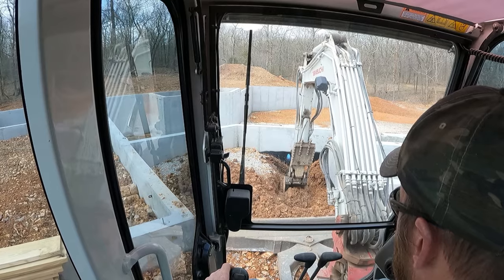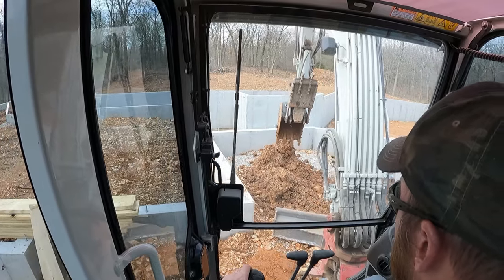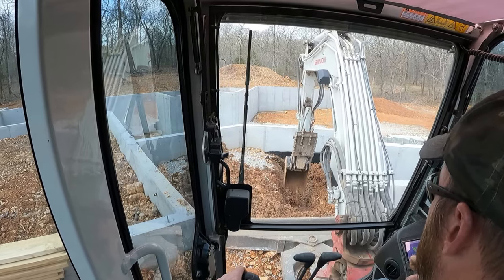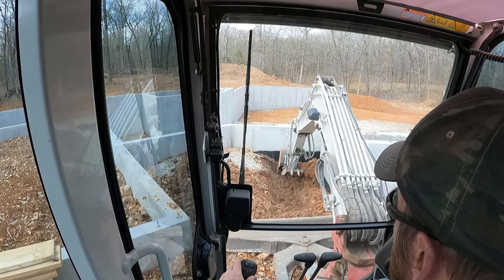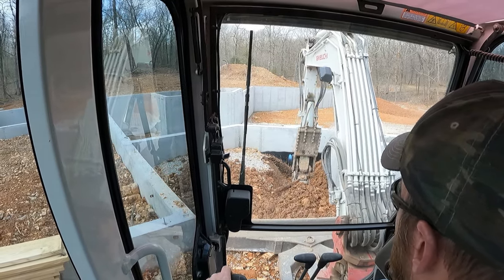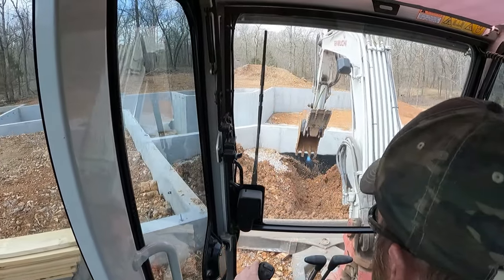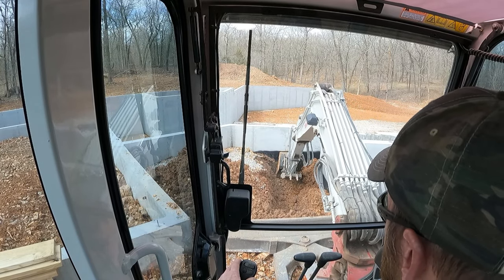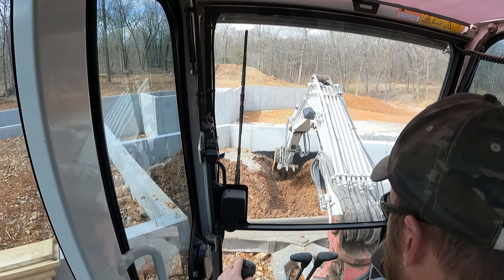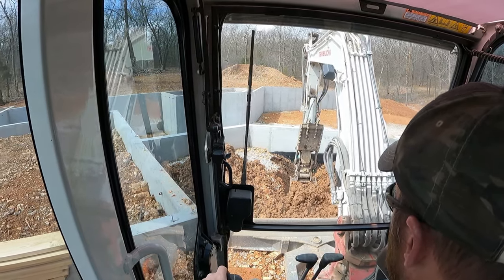And the reason that they do two lines here, the sewer bill is based off water usage per month. So let's take my house for example, I got a 12 zone sprinkler system in my half acre yard. In the summertime, I will go through 70 to 80,000 gallons of water a month to keep my fescue green. So I've got 2 meters as well. I mean, if you based your water usage off of 80,000 gallons of water a month, your sewer bill is going to be quite a bit more. So you can actually run 2 meters here. And then in the wintertime, you can actually disconnect or shut that meter off to the sprinkler system, because you won't need it. And so that can kind of save you a little bit.